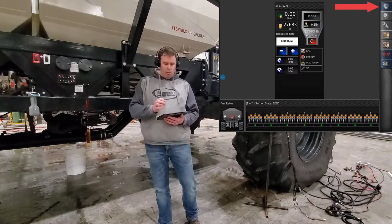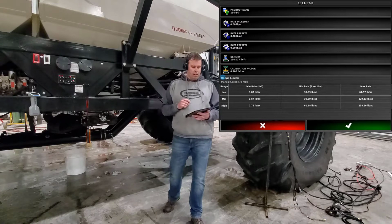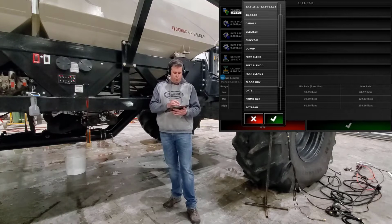You'll notice that 1152 was in the tank, but that's not what we're calibrating for, so we're going to want to change that product. To change that product, we'll hit 1152. It brings out our list. On the top there, you have your product name. So we'll want to change that product name to what we're calibrating for. We touch on it, and we'll scroll down to what we are actually calibrating. And today we're going to be calibrating floor dry. Touch on floor dry, hit OK.